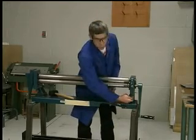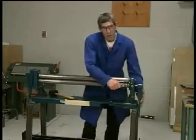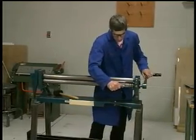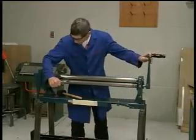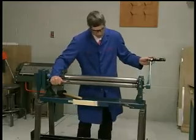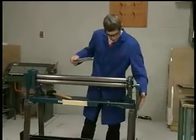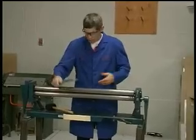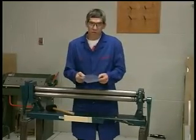Get this screw nice and snug here and there. It should be about an even amount of tightness on both sides so that it clamps with a fair bit of resistance. That means we've got the lower roller set to the correct height to accept the 0.025 material we'll be using.